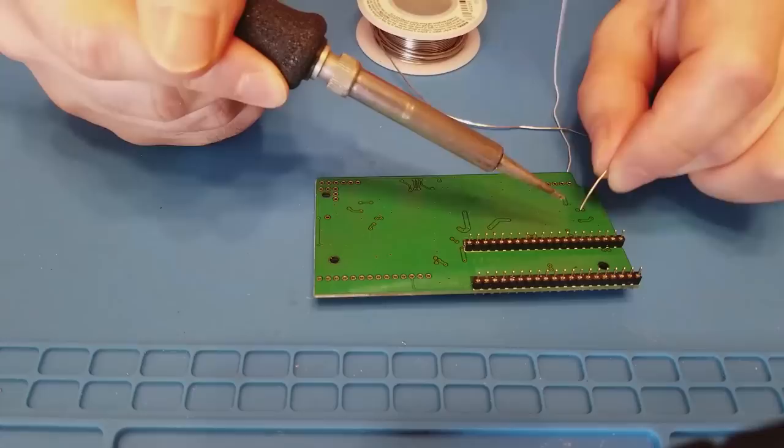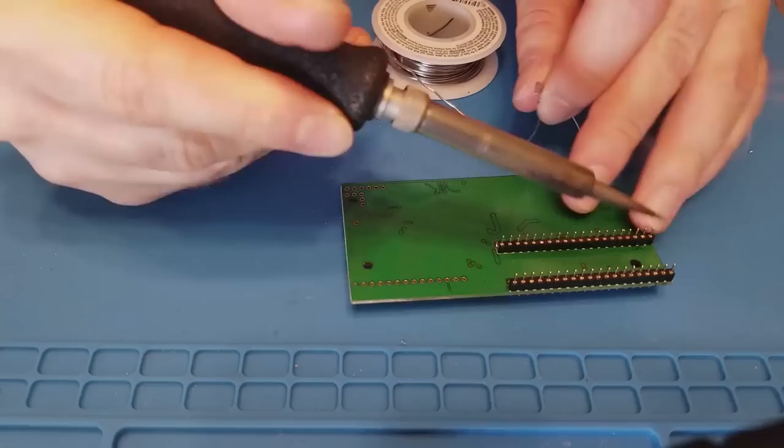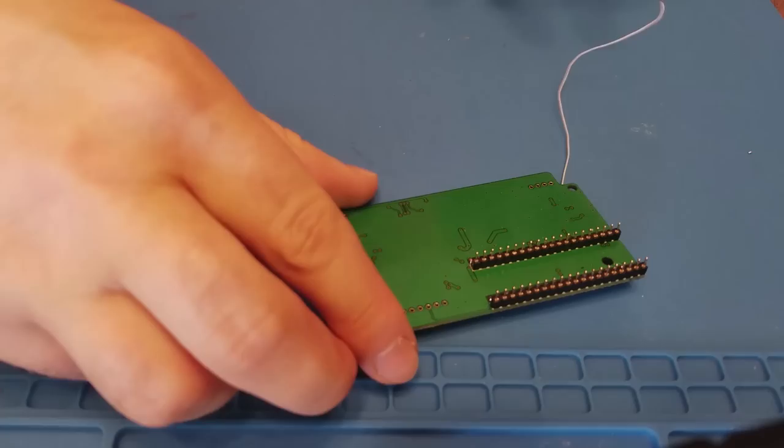Unfortunately, we're not going to be able to put another 40-pin socket here for the PPU. That's because when you do a front-loader NES install, there isn't enough room for the NES RGB and a socket and the PPU inside of the chassis. So, unlike an NES top-loader install, where you would do a 40-pin socket for the PPU, which makes things way cleaner and easier, we're going to need to solder the PPU directly to the board this time, so we're going to have to make sure everything is perfect here.